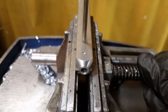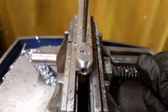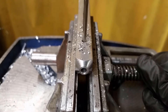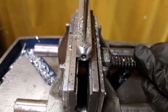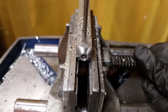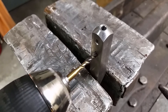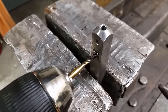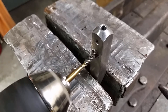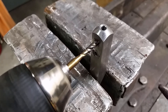Two 3.3 mm holes are drilled on my drill press. It's important to hit the middle of the square stock, otherwise your holes won't line up. A cordless drill is used for threading the M4 holes into the holder. The torque adjustment makes it easier not to break a tap, and it's faster and more comfortable.